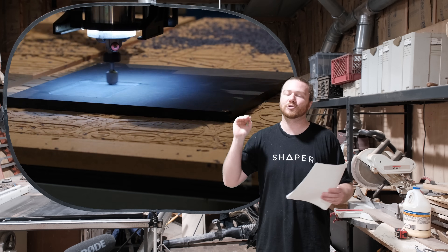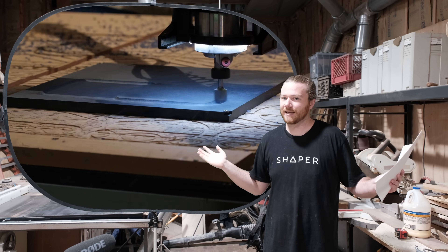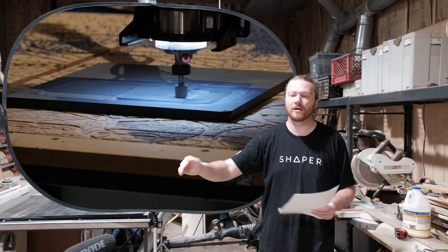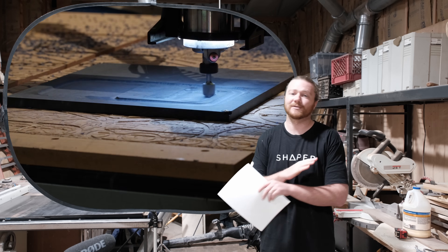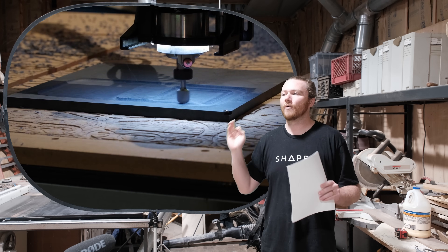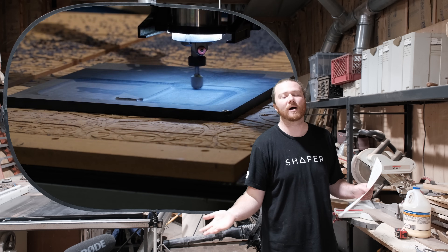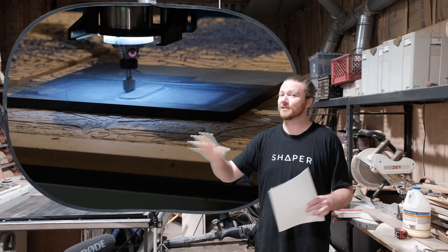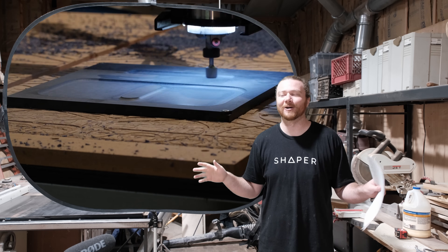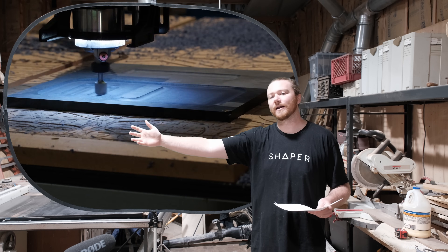Integration and control is a huge creature comfort. If your business is depending on this machine every single day, a spindle is going to knock out so much time and effort in every stage of design and manufacturing — I would 100% get a spindle. But if you're just going out to the garage occasionally and $1,000 isn't in the budget for your hobby right now, start with a compact router, understand its limitations, and maybe later graduate up to a spindle.